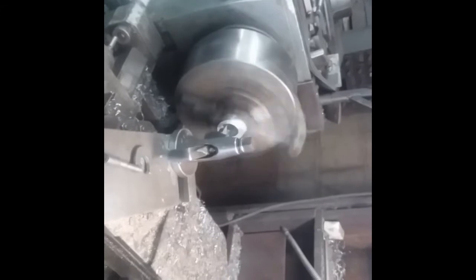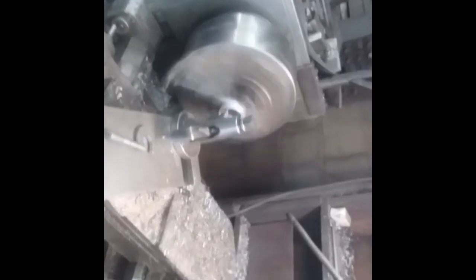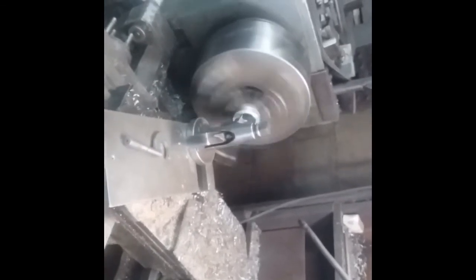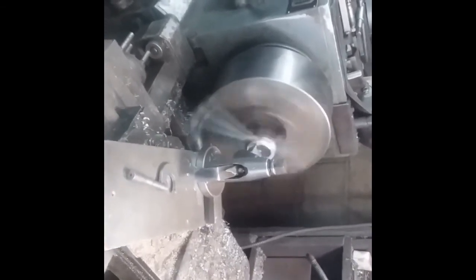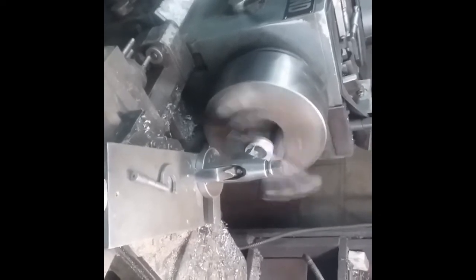Does the lateral movement matter much? You mean this way? Yeah, that way. There won't be but a thousandths. And as far as getting it fit up, the connecting rod has that much on each side between the piston, on the piston pin to where it hits. So I can move it 12 thousandths that way. That's not an issue.